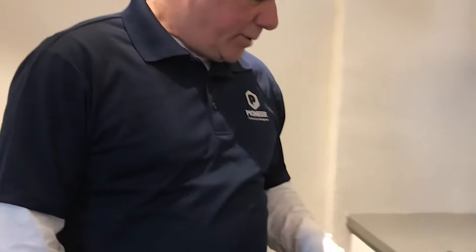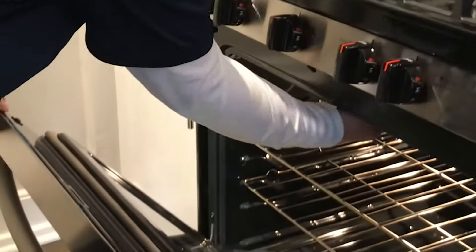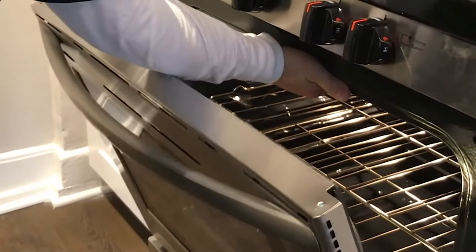Hi guys, we want to show you this video today on how to shut off your gas line behind your stove. If you smell any gas in your apartment, first and foremost, we would suggest that you check your burners to make sure that all the buttons are in their off position. And if that seems to be okay and you're still smelling gas in your unit, perhaps at this point you might want to pull the stove back from the wall by just grabbing it here and pulling your stove back.